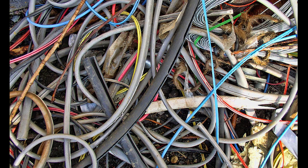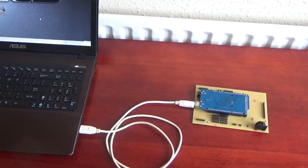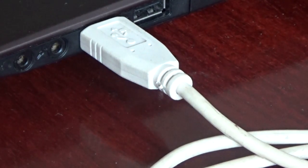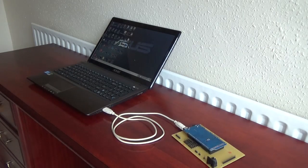Oh, and by the way: if you mess up when you're wiring it and you have shorts in your wiring, the encoder will tell you which wires are shorted and let you sort it out before you start, so you're not left wondering why it doesn't work. So, let's take a look at how we set it all up with a PC. Just plug in a USB lead between the encoder and a spare USB port on your PC. You'll have to load the drivers for it the first time you connect it, but that's easy enough to do and it's covered in the instruction manual.